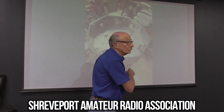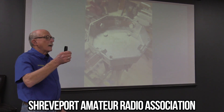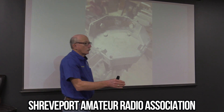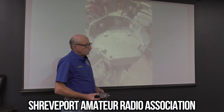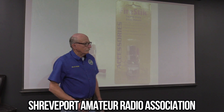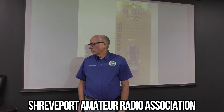Question: how is that box smart enough to know the resonance of the signal coming up the line — is it just going to be self-resonant naturally? What I had to do was take each individual hamstick, put it on top of my car, and tune them at the same frequency. When you put them on here and up on a pole, it's going to change a little bit, but it didn't change enough to worry about adjusting the lengths of the whips. My antenna tuner and radio take care of that. To add to that: all of the antennas are only resonant at their frequency. If you're putting 20 meters into the 40-meter antenna, the impedance is so high it does not affect the other antennas. By putting a signal on whatever band you want, only the resonant antenna will actually transmit — RF goes to the path of least resistance.